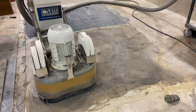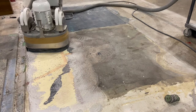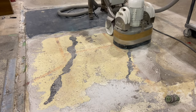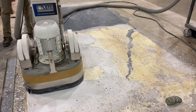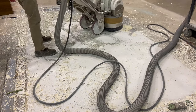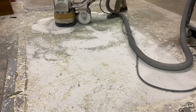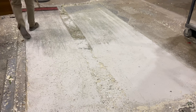As can be seen in the video, underneath the resurfacer and the underlayment is epoxy, and below that is polyaspartic — so multiple coatings on top of this tile floor. The ultimate goal is to get it completely clean and ready to be coated. The PCDs have to be used to take the bulk of that material off before the next step can take place. Once finished, the bulk can be removed by squeegee, broom, or vacuuming to clear it off.